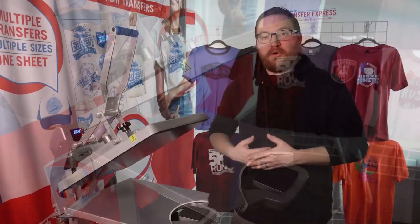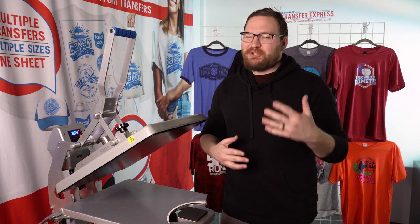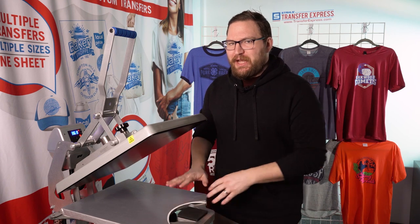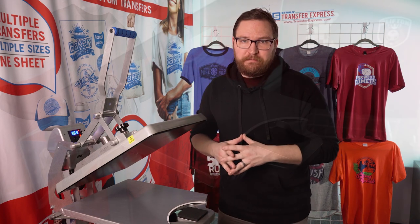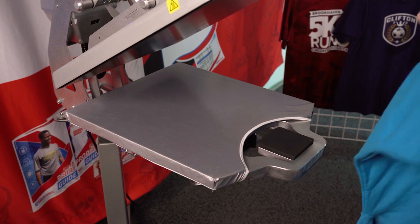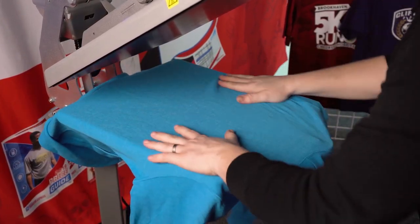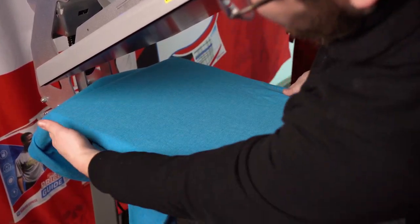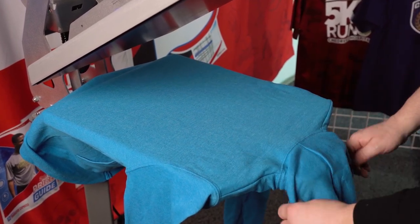Remove the shirt from the platen. We showed you how easy it is to print your shirt and tag at the same time on a regular t-shirt or long sleeve, but that's not all you'll be pressing. For alignment and easy threadability switching front to back on a wide range of apparel — for a zip hoodie, we wouldn't recommend printing with the seam on center without raising the print surface, but here's how easy it prints to the back. Just line up the seams and the back of the shirt — check your side seams and it's ready to print, easy to remove with the quick slip pad protector.